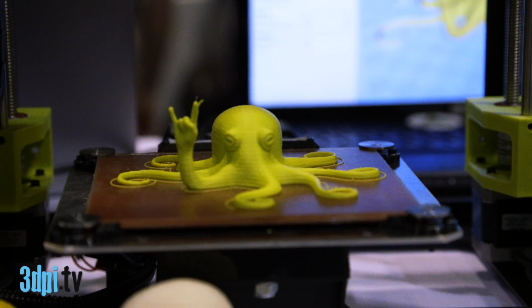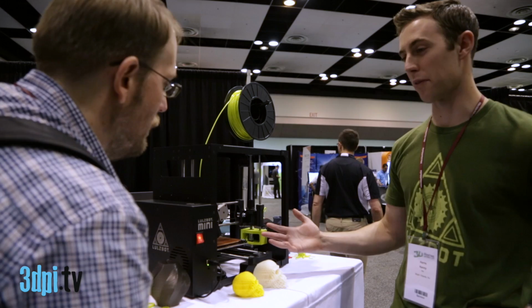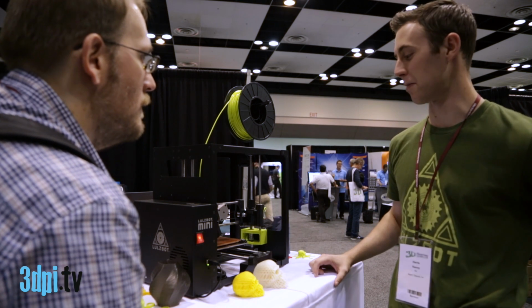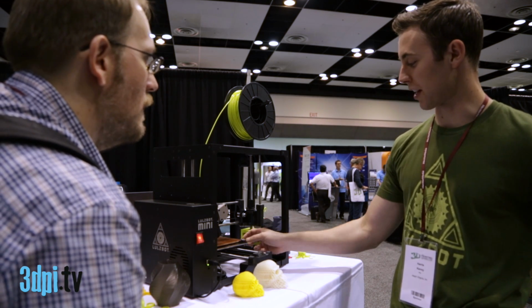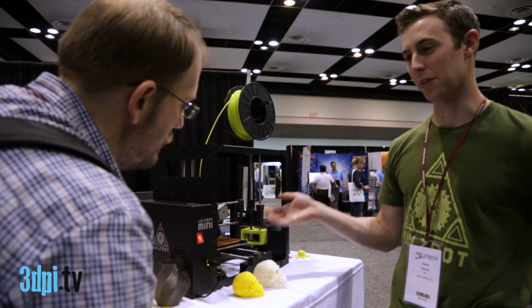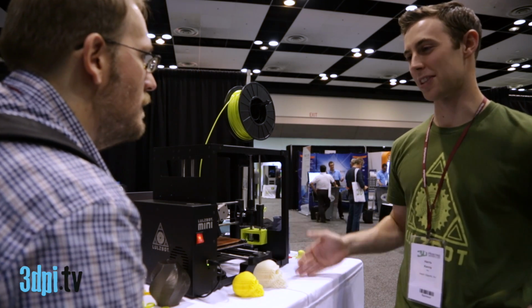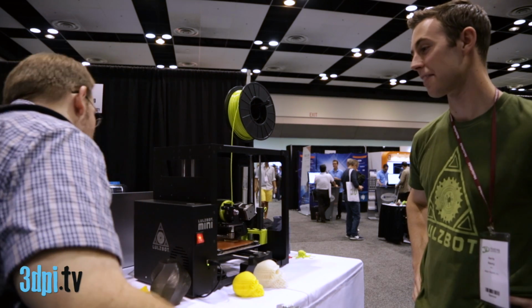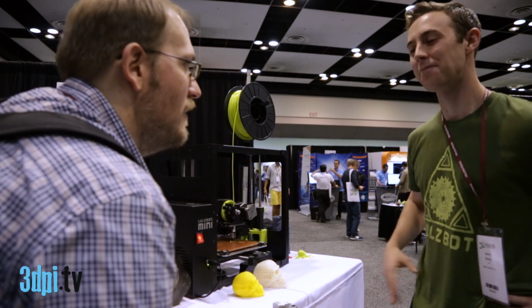We've got some 3D printed parts on here. So you know, we're part of the RepRap community. This leveling solution, we refined it, but it came from the RepRap community, and so we've got 3D printed parts on here, and some of these are actually Ninja Flex as well, so it cushions a little bit when it's going through that leveling process. And then you have something at the back of the print bed, which you can't really see, but it cleans off the nozzle as it's printing.